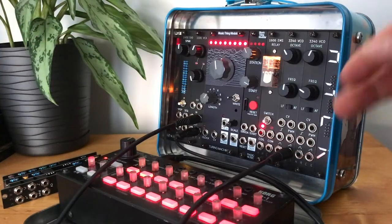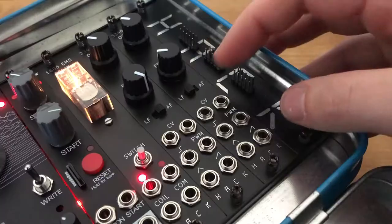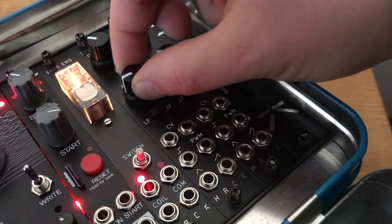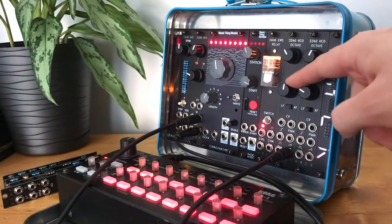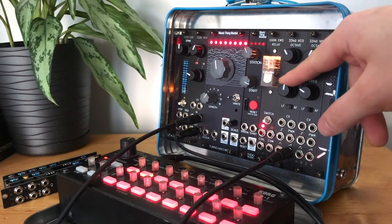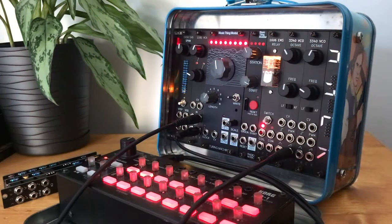So the module can act as an audio frequency oscillator or a low frequency oscillator, and you choose that with this little slidey switch here. In audio frequency mode, this frequency pot here spans two octaves. So you've got one octave going down and one octave going up, and it's detented in the middle so you can feel it slot into place and you know it's in tune,